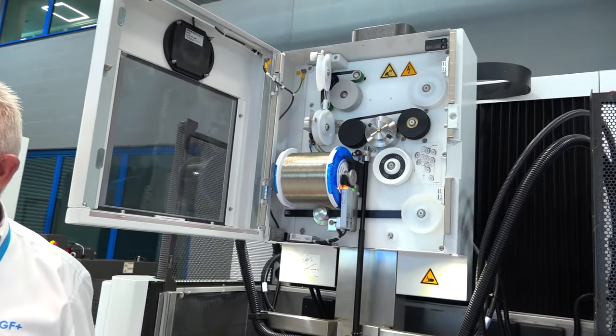Machines are quite fast these days, but we have a spark-to-spark time, and what we have to do is switch off the generator, prepare the wire, re-thread the wire, switch back on the generator. Now, that might only equate to 26 seconds, but if you look at multi-cavities, 500 cavities inside a block, and you can imagine having one wire break per cavity, that does equate to quite a lot of time. So to summarise, SparkTrack, we're talking about using less wire, protecting the wire, and making real-time changes for savings. Absolutely, and a big cost saving to the production environment.